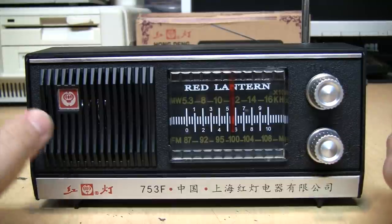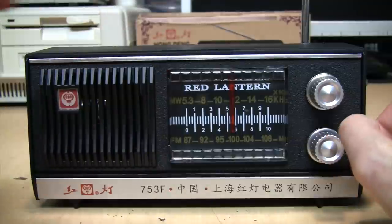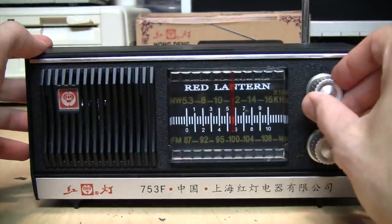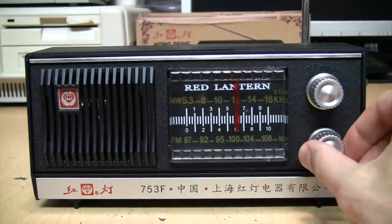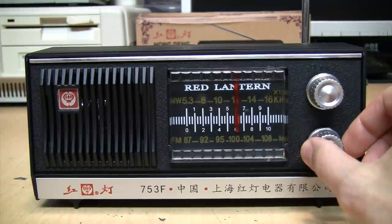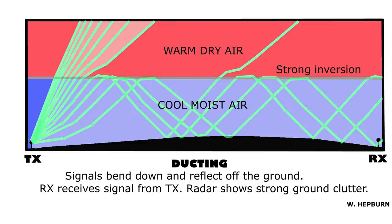That's the sports talk station on 98.7 FM, and the dial calibration is a little bit shifted up — you can see it's almost showing 100 MHz on the dial. It's a little hissy and choppy, but that's actually a station from Maryland and I'm here in New Jersey, probably about 150 miles away. So we must be getting some tropospheric ducting tonight on FM, which is long-distance reception within several hundred miles, usually occurring during warm summer evenings — and it is definitely one of those today.